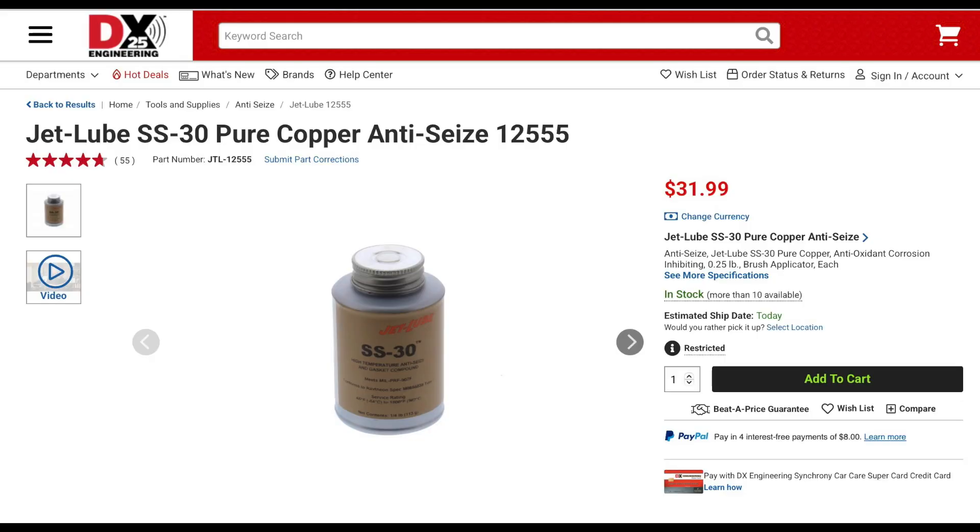These towers are also climbable with the proper harness. To get started, download the manual from either the DX Engineering or the Carlson website — I'll put links in the description below. There are a few things to note prior to assembling this tower. First, the hardware is stainless steel. Since stainless steel is prone to galling, we recommend that you use anti-seize compounds such as JetLube SS30. As you assemble the tower, leaving the hardware slightly loose is a good idea — this will make the assembly easier. After you've finished putting the tower together, you can come back and finish tightening everything up. Also, avoid using a power driver to tighten the hardware, as even with anti-seize you can still cause the hardware to gall.